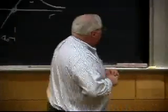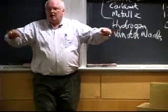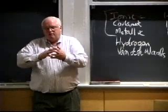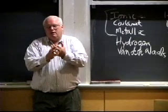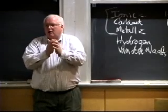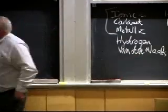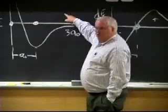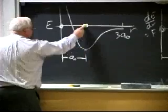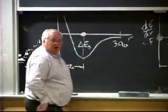But between the bonds, if instead of extruding it and getting everything to line up, I just made some Kevlar and let all the strands or backbones of the covalent polymer go in all kinds of different directions, and I try to pull that apart, all I have to do is pull apart a van der Waals bond. Well, the energy of that van der Waals bond is 1/20th the depth of this. The electron volts we're talking about is the depth of this thing. That's delta E of bonding, and that's what the electron volts I'm talking about.